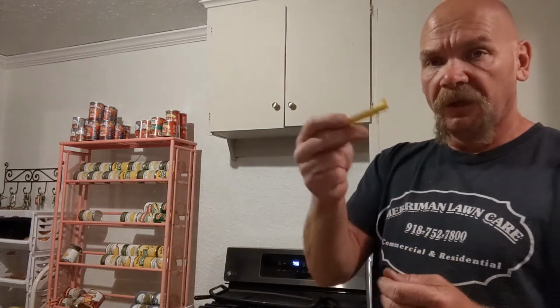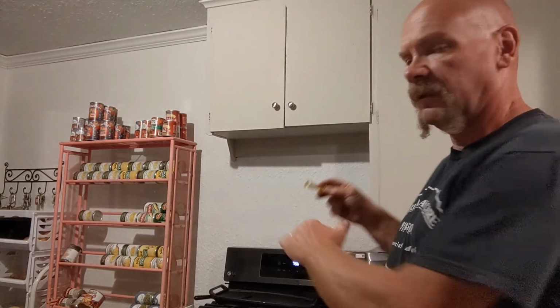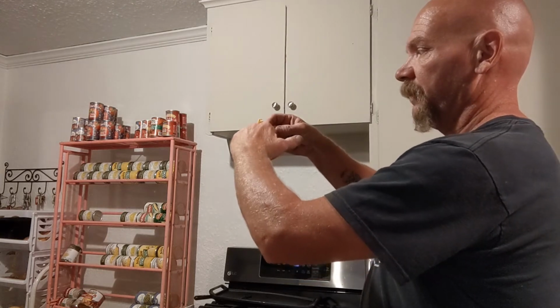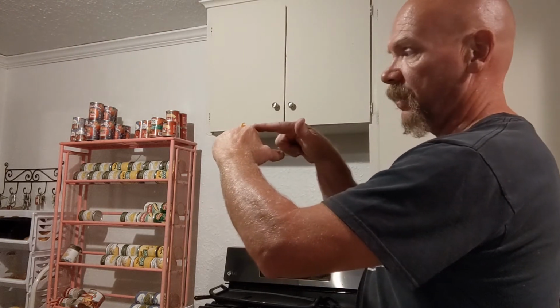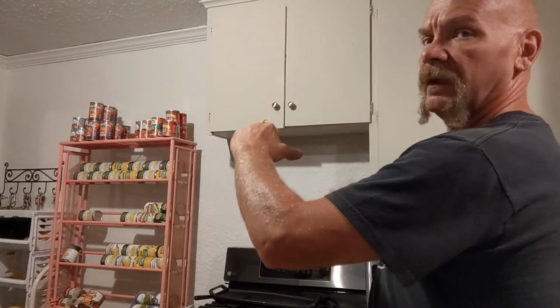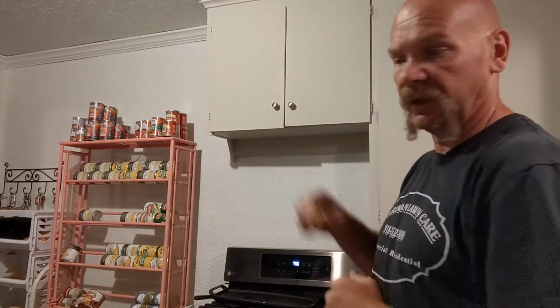So let's lay this up here. We're going to put the board on it. Then on this end, we're going to bring this up so that the level shows where we need to be at, and we're going to mark it. We're going to put a mark on that end on the wall. And when we put a mark on there, we know that's where the top of our bracket needs to be. Pull our board down and put that bracket up.